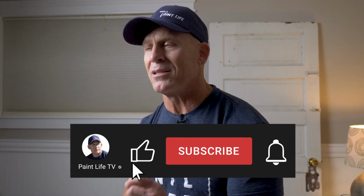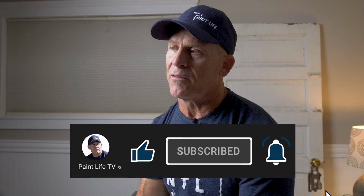So one tip when it comes to catalyzing your product, you're always going to want to leave a certain amount left behind for touch-ups. That you should, like in a quart can, do a little bit of pour off, because you never want to end up with nothing to be able to do touch-ups with. So that's just a professional tip. Always leave something behind for touch-ups, because once you do catalyze it, whatever's left the next day, it's going to be in the can. It's going to be completely hard and non-usable.